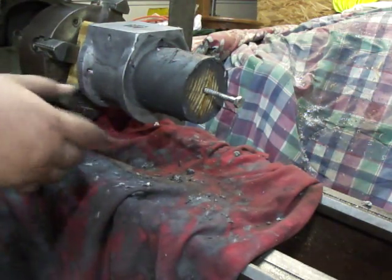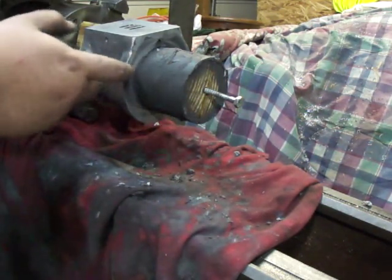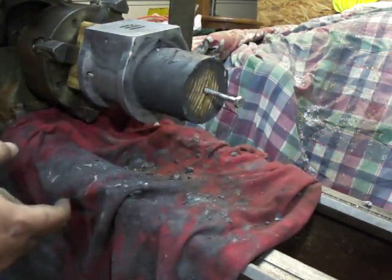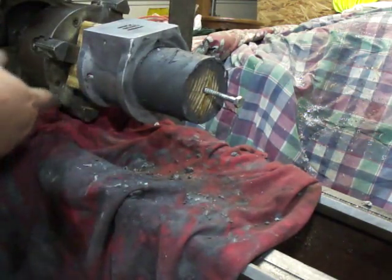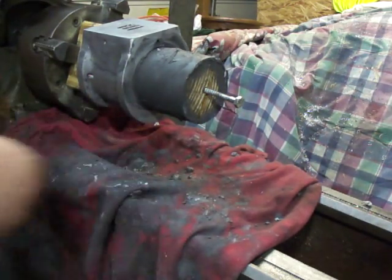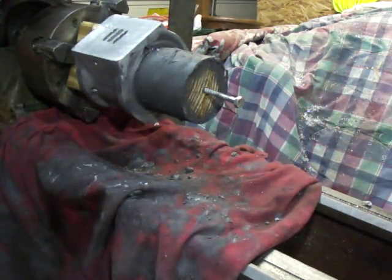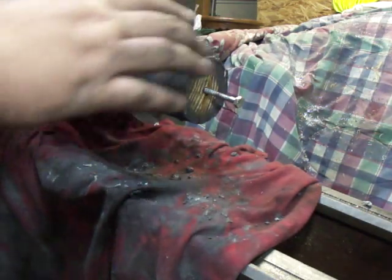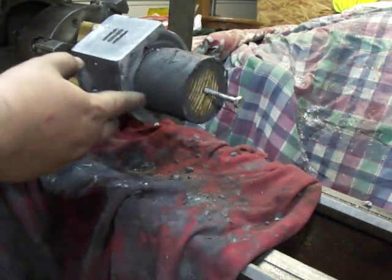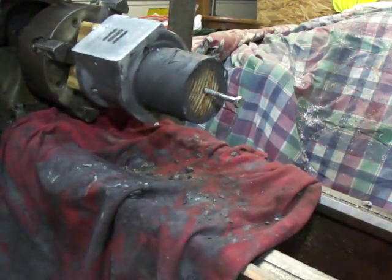You want a mandrel that's actually softer than the material you're trying to hone so that the grit sticks in it rather than the bore. I'm using a piece of 2x4 I found on the junk pile — cut it, screwed two pieces together at this end with three screws, and turned it down on the lathe to just under the size of the bore, just a few thousandths, so it was just barely wanting to go on. Then I put grooves about every inch and a quarter all the way down to hold the compound.